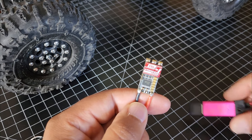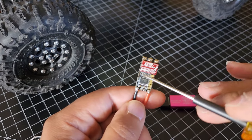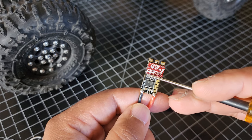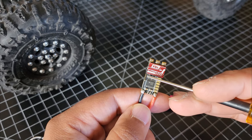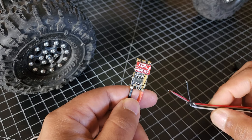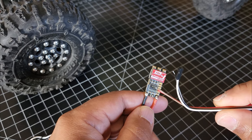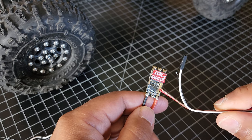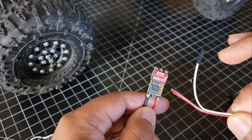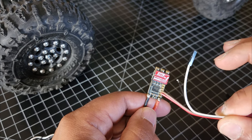Those pins are on the Emax ESC — there are four pads and it's the top two. I'm going to try to solder those on camera. If you're not super familiar with soldering or soldering with thin 30-gauge wire, this might not be worthwhile, because if you bridge the pads it's not going to work. This is probably the hardest part — soldering to these pads. Let me get my iron set up and we'll run through the bootloader process.